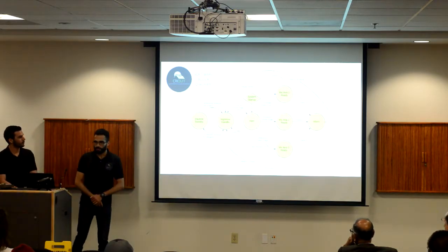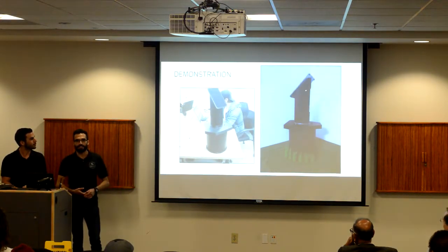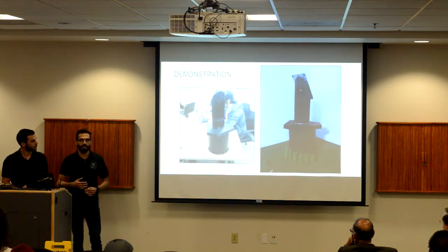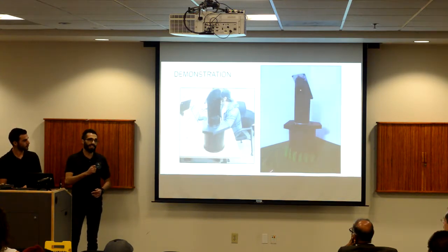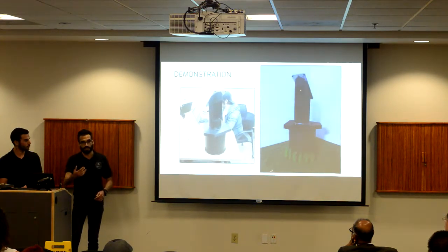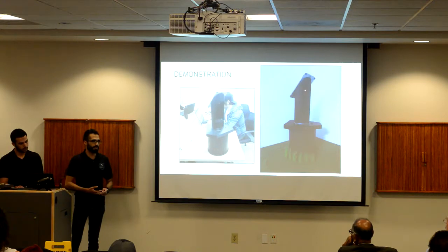This diagram gives an overview of the software flow that implements the various stages discussed throughout the presentation. Starting in the day stage, the device is held in a low-power standby mode, remaining dormant until a scheduled event implemented by the on-chip real-time clock wakes it up via specific pin change events, marking the transition from day to night. In night mode, the rising edge from an envelope detector pulls the device into alert mode. Once in alert mode, the next rising edge from any of the three envelope detectors determines which pair of microphones activates and puts the device into ID. If a positive ID is made, the device proceeds to attack, where it locates the sound source, rotates the sound reflector, and activates the speakers. After this, the device returns to sleep and the process starts all over again.